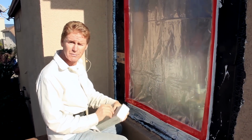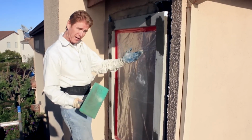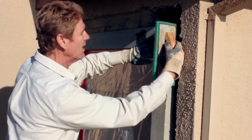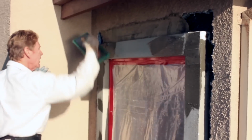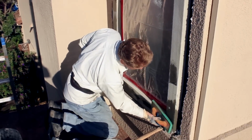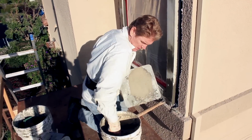It's quite simple. Okay, guys, we go from polybond, which is to adhere molds. Of course, we're not adhering it on stucco, but we also do our joints with polybond and make sure you have mesh tape, otherwise you can get a crack. You clean it here, clean it here, clean it, boom, sides. And why do we use the polybond? Because it prevents cracking in all these joints, and you should have mesh tape there too. I always like to use a bit of mesh tape myself. We switch from that, then we switch to cement.